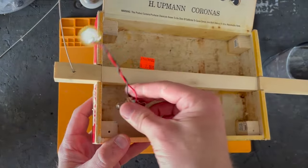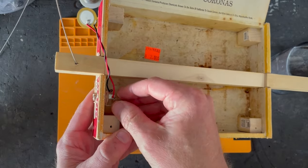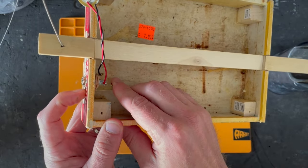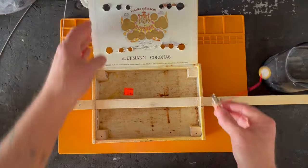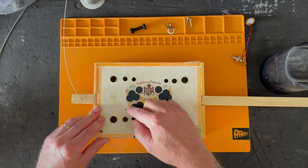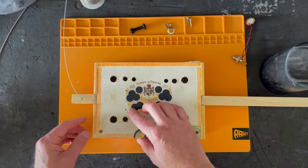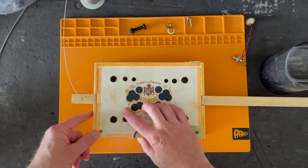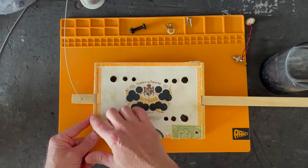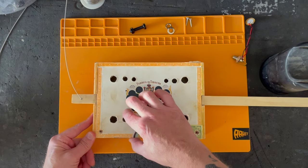I'm going to go ahead and insert the jack there — it goes in quite nicely and you can see it sticks out enough that we can easily get a nut on there. So I think we're good to go with that. Now, remember this is where our bridge sits because we marked those spots. You want to pick the side that's on the same side as your jack. So if you drilled your jack hole up here, you'd want to mount your piezo here; if you drilled your jack hole down here like we did, you'd want to mount your piezo here.